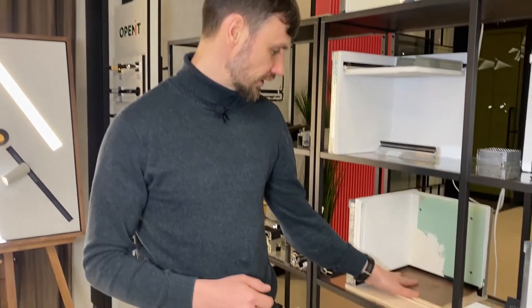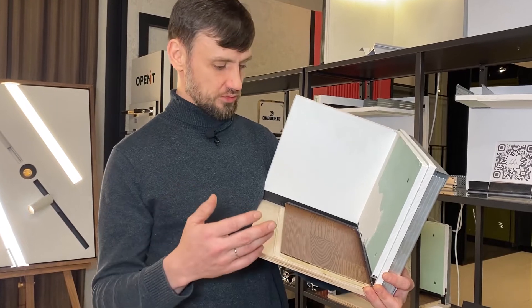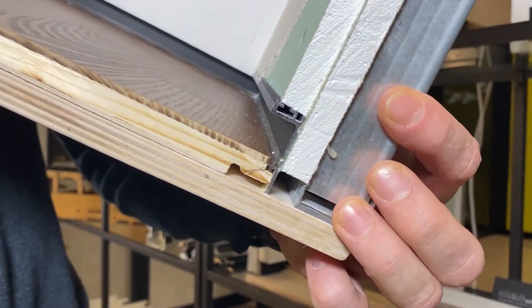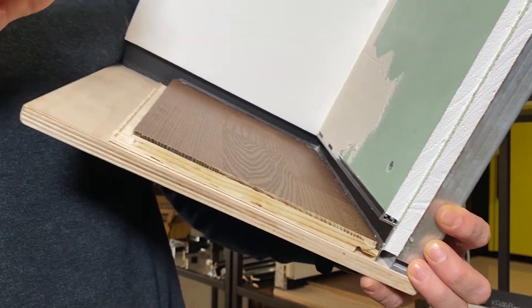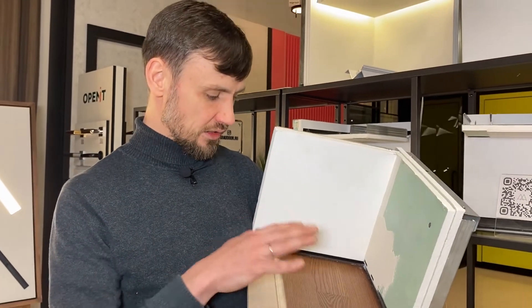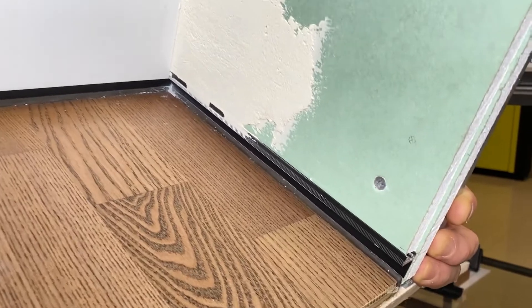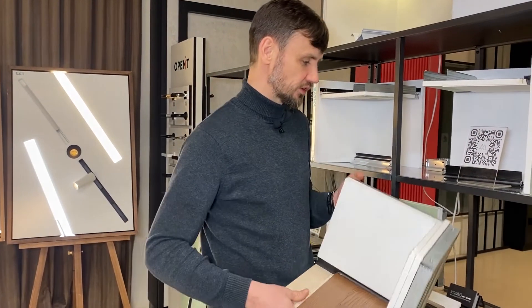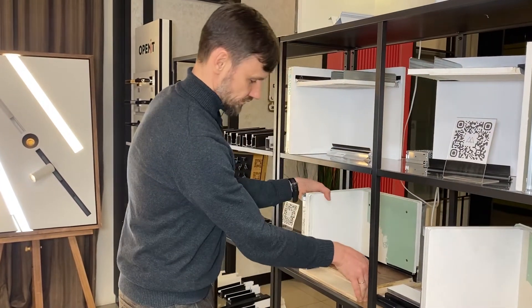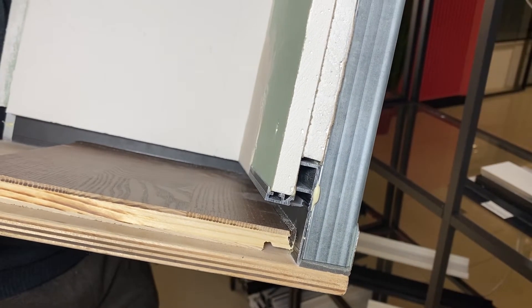The logical conclusion of the ceiling abutment topic was the junction of the floor. We have developed two systems: with and without lighting. This mock-up shows the shady plinth without LED lighting — it will be masked and painted. Inside we have used acrylic sealant and it won't be noticed. This is the profile without lighting, and we also have an LED lighting profile for the hovering effect.